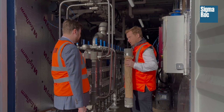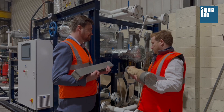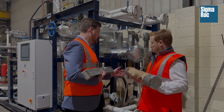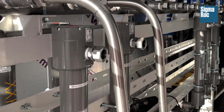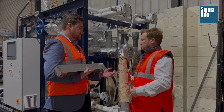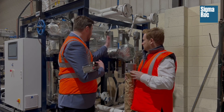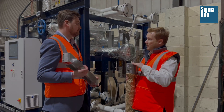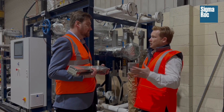So what's the secret behind the membrane? We've got two different types — this one is a little bit bigger than that one. What's the difference? The difference, as you were already implying, is purely the diameter and size. The higher diameter means more hollow fibers. So going from 4 to 8 centimeter diameter, you go 4x up in membrane area. In the next generation membrane, it might be 25 centimeters in diameter. You could have a unit that is 15 to 20 times bigger, still fitting in more or less the same slot. So scalability is not necessarily how many containers we need — we could just increase the diameter and still keep the same number of containers but achieve far greater capture.